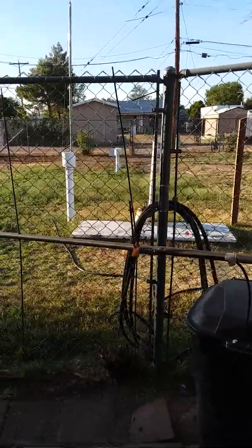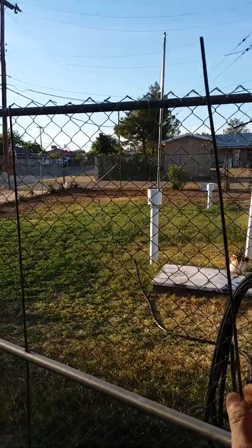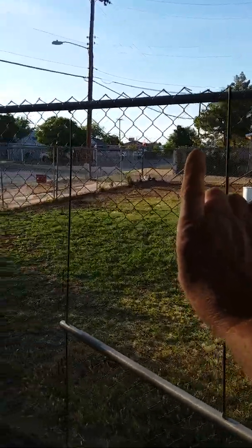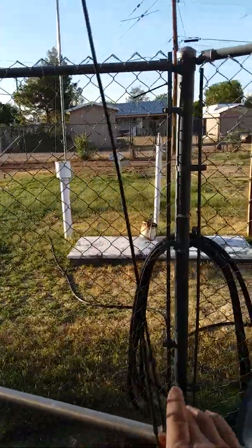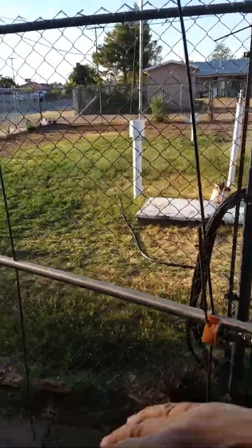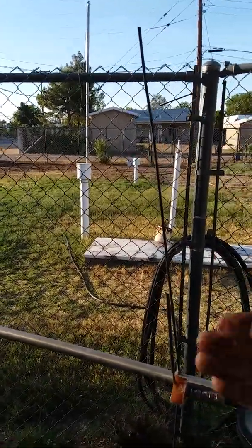position. And what that means is that you've got vertically polarized signals. So right here, your signal is going to radiate off of this element, and it's going to radiate with an electromagnetic field that comes off of there, and these little electrons or little magnetic particles are lined up in a vertical fashion as they leave this antenna because it is vertically configured or vertically oriented. So this is a vertical polarization. Now if I flip this over on the other side where the elements are going this way, the signal is going to be horizontally oriented, okay?